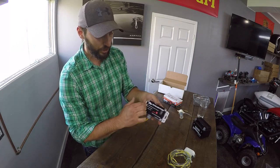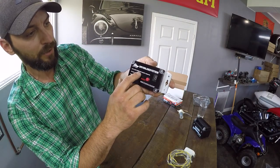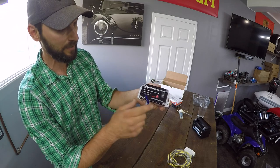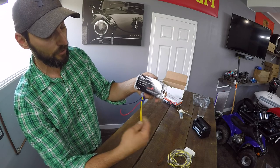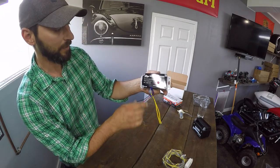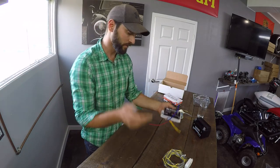The wiring instructions are actually on the box itself. The blue wire is our power input — polarity not sensitive, so it doesn't matter how you hook up positive or negative; it's automatically going to rectify itself. The yellow wires are for the pickup block, so those will hook up to this. And then we have a black and red wire — those go to the pump and they are polarity sensitive, so you want to make sure you connect the red wire to the red wire on the pump, and so forth.